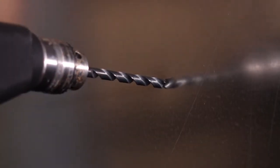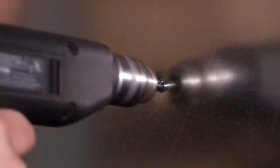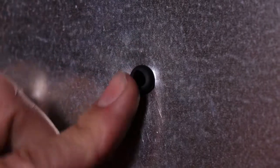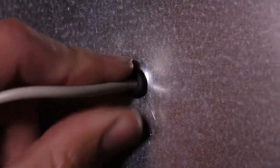Now, once you have chosen the location on the air duct, drill a quarter inch hole into the air duct. Next, place the grommet that came with the sensor kit into the hole. Push until it snaps into place. Next, you are going to insert the sensor into the hole. Make sure the sensor goes all the way through, just like this.